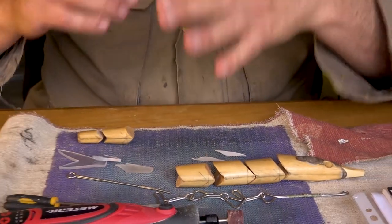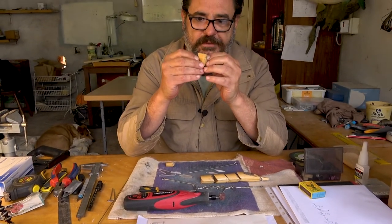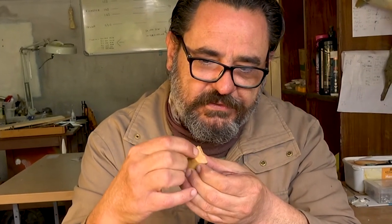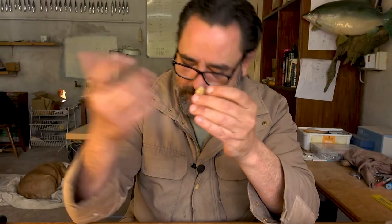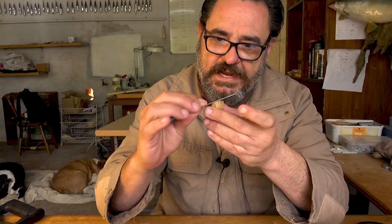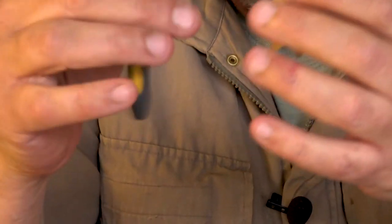I've already bent my circle, so let's go into the tooling. These sections — if you remember, we filed them very rough — if you have a close-up look, you'll see that I've actually sanded them all down. They are perfect angles now, all perfectly aligned with the center slot. How I've done that is a simple process of hard elbow work and needle files. Best thing to use for this sort of thing because you've got flats on it. As long as you've got a flat on a triangular or flat file, you can get those sort of flats and keep those planes as level as possible.